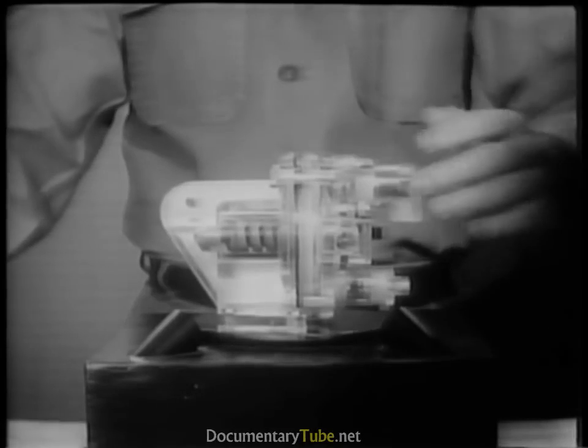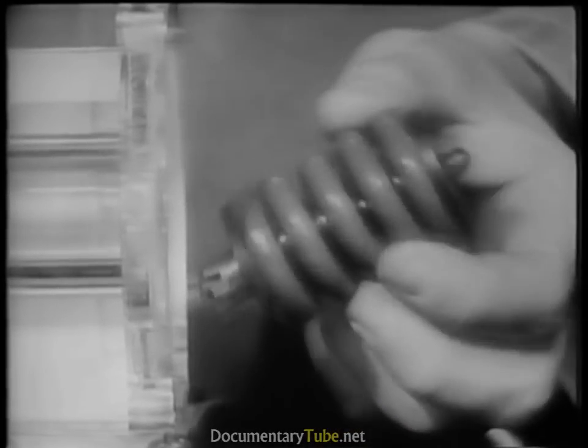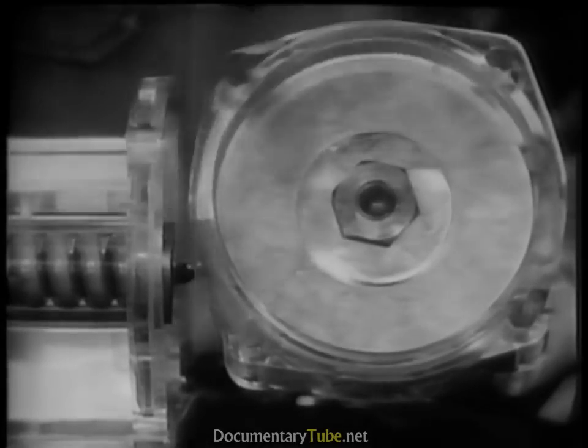Let's disassemble it and find out how it works. The valve is operated by a plunger pushing against a pressure-regulating spring assembly. The spring pushes down on an airtight diaphragm. The diaphragm operates the rocker below it, which in turn operates two valves: the intake valve and the exhaust valve. When the brake is applied, air from the reservoir enters the intake valve. The exhaust valve permits the air to escape when the brakes are released.